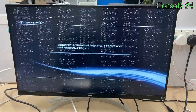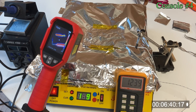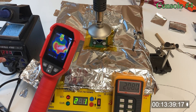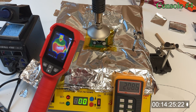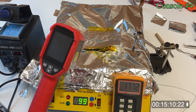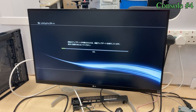Now let's move on to the console with the video output artifact. This is console number 4 that I discussed in my last video. I really hope a reflow works for this console. Looking back at my footage, it doesn't even reach the correct reflow temperature, so it is definitely not a successful reflow — and I didn't expect too much from it. Somehow, after the reflow, I don't have the video artifacts anymore. I won't say it's fixed because I think it's just barely working.